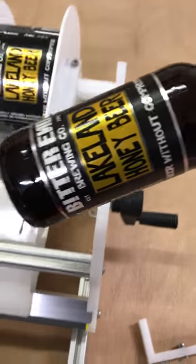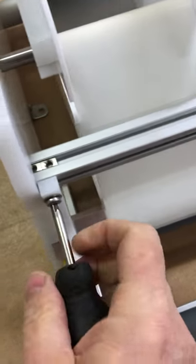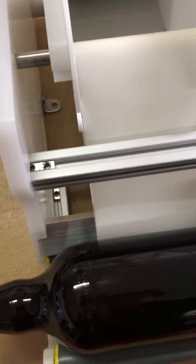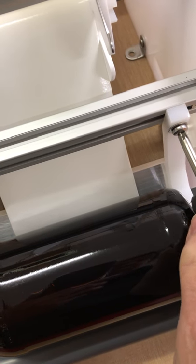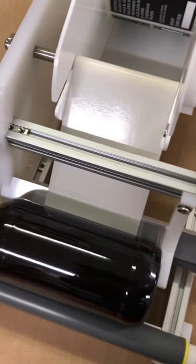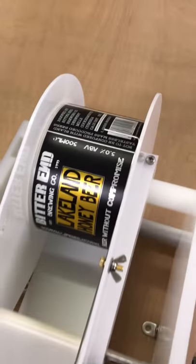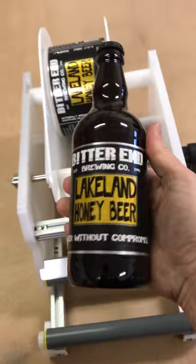Just noticed these are on upside down, but to change that we just have to reposition — just take that label off. I've set that up the wrong way around. Get the bottle position lined up, just move that adjustment, turn the handle until that's lined up again, and that should be the bottle with the labels the right way around.